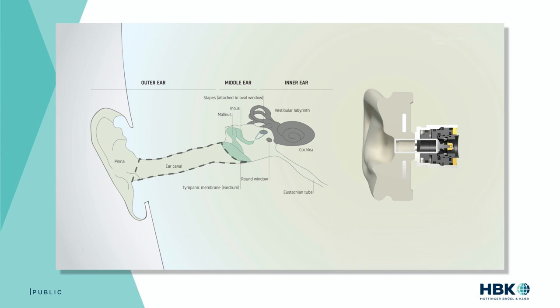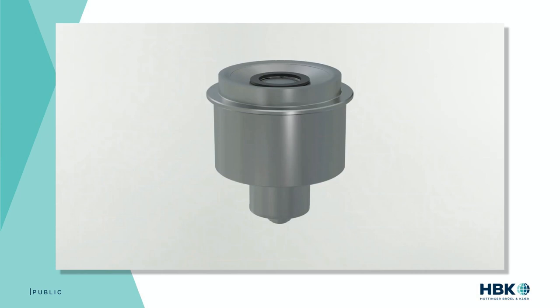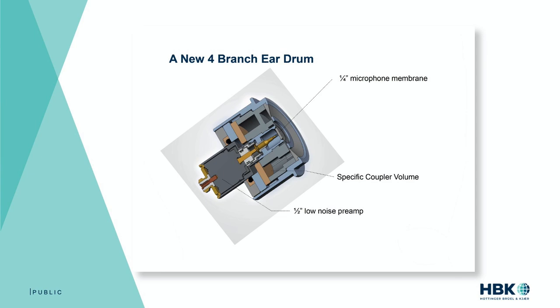At the end of the 5128's ear canal, it's terminated with an eardrum assembly with an effective area allocated to constitute the load of the eardrum more accurately, and that canal termination is at an angled orientation that faithfully represents that of a typical human eardrum relative to the ear canal — contrasting with the 7-11's microphone diaphragm that's simply parallel to the measurement plane at the end of a straight cylinder. To realize the acoustic impedance from this latest research required greater resolution than any previous standard, so the 5128 eardrum assembly's acoustic circuitry involves a far more sophisticated four-branch design versus the two-branch 7-11. And the 5128's coupler design requires essentially no cavity volume in front of the diaphragm.